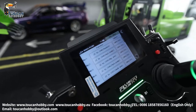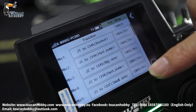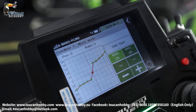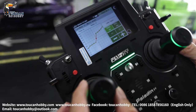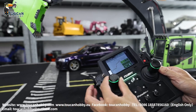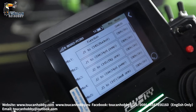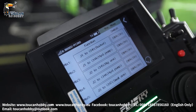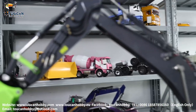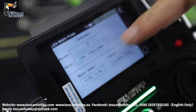Let's see the front arm. Front arm is controlled by J3 — J3 and CH4 — the small front arm valve, J3 and the front arm valve, 11 points. You check all these curves are different depending on the valve — where it starts to open, how quickly it can move for the operation. So totally we have four controls: one is bucket, and bucket starts the pump, arm, front arm, and big arm, and mixed control for the pump. All together we set up six mixed controls.